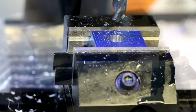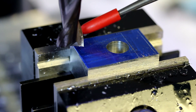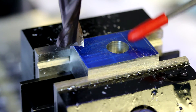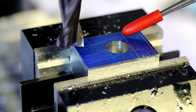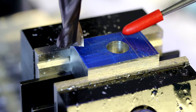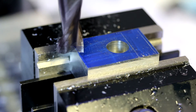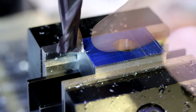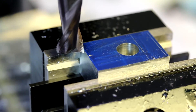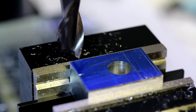Our counterbore is done. The last major machining operation is to remove the majority of this face down to a particular depth. The plans call for 30 thousandths, but I measured and on mine the offset is 45 thousandths, and I want a little more than that for clamping, so I'm going to take this down to 55 thousandths. I'll bring the cutter down until it touches and leave a fine scratch on the surface, then set zero on my hand wheel. I'm going to start with a 20 thousandths depth of cut.